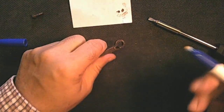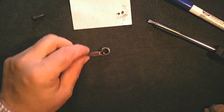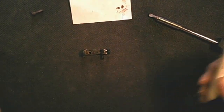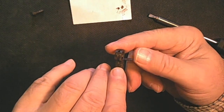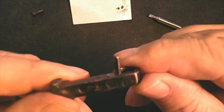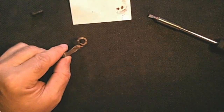Okay. All right. So let's take this downstairs and rinse it off. I'll be back in just a moment. And we are back. I do want to mention, I forgot to mention it before, when you use this kind of, or actually I think any kind of bluing, you need to degrease the part before you start. And I had done that before I started working on it with the Dremel. So I didn't feel bad about that. It looks like it's fairly well flat. It's in good shape. Now I am going to put a very, very light dusting of oil